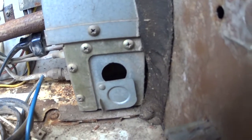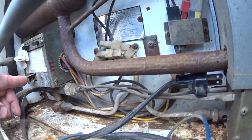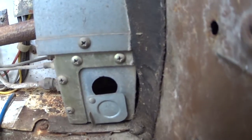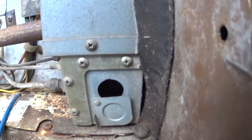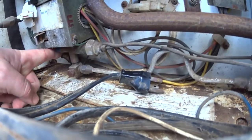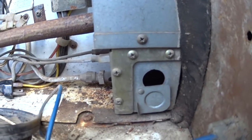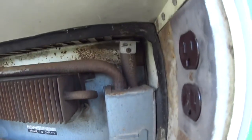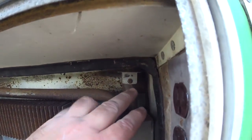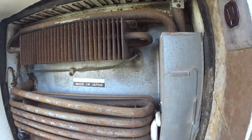I have this little access cover open because sometimes when the thermocouple or the igniter goes bad, you may need to manually light it. When you manually light it, you just put a stick lighter in there and light the flame — again holding the button the whole time until it ignites and stays lit even after you release the button. At that point you'll start noticing that up here at this chimney everything gets really warm, rising to about 190 to 200 degrees, and the refrigerator starts cooling.